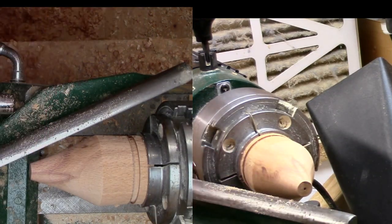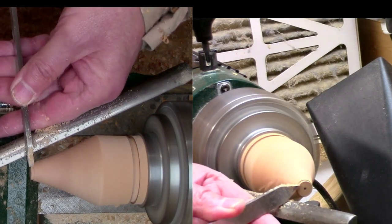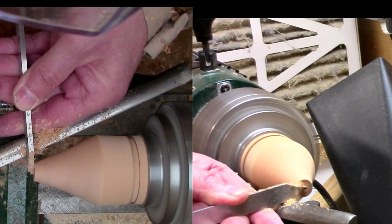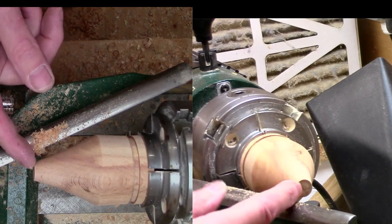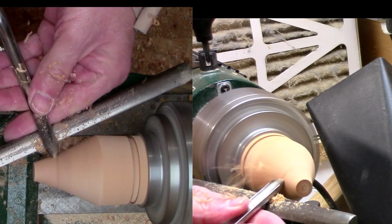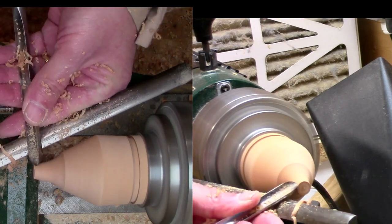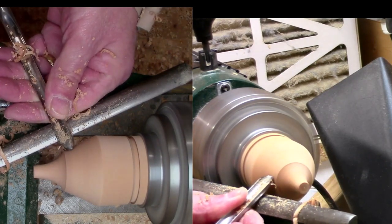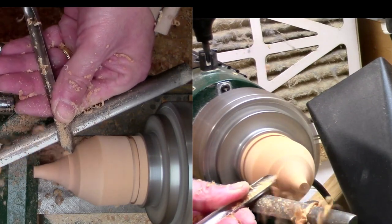So we've just got the end to clear. Just use a skew to do that. If you're going really slowly, this will avoid tearing the grain too much. If you're going very quickly, it's guaranteed to tear the end grain. And that's fairly clean, so we can actually start shaping it now. I just want to get some of this down because we're going to make a teardrop shape at this end — we want to keep the bulk of the material at the top end for stability. Just put the tool in and just lift the handle, so it always goes in with the bevel and then lifts up into a cut.